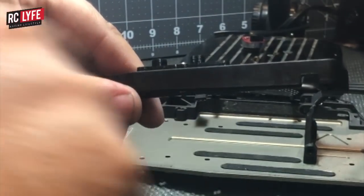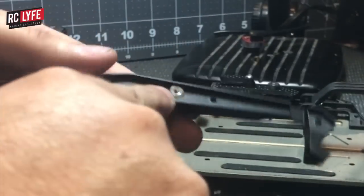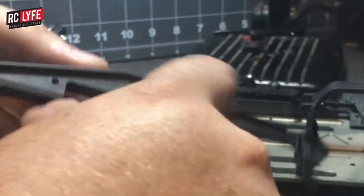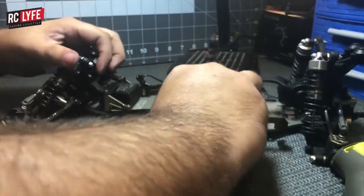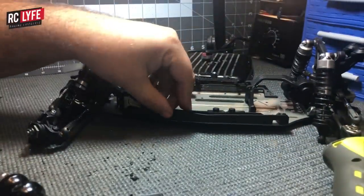When you're done, the mount should be flush with the top of the rail. If it's bent down, you've tightened it too far. If it's bowed up a little bit, you haven't tightened it enough. The key is to recess it so it doesn't interfere with the side rail of the chassis at all. Go ahead and tighten that up, then reinstall the rail on the side of the chassis, replace all the screws, and when you're done you have a nice clean look that looks stock.